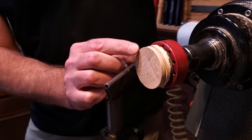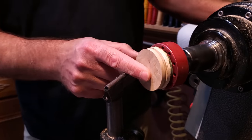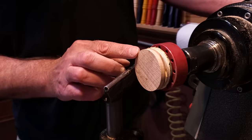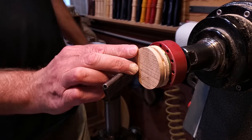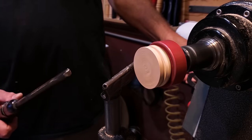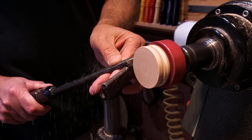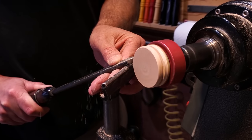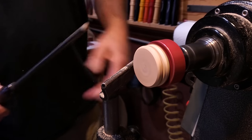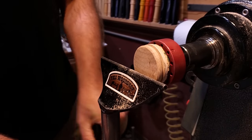What I'm going to do is just clean up that edge first and then we'll start working on putting some beads on this thing. That's what I really wanted to do — use the beading tool. I did one the other day just to see if it would work once you throw it off center, and it looks really cool. Let me get the edge cleaned up here and then we'll put some beads on this thing. And the lathe speed is back up to 2,500. Let's go ahead and use the beading tool now.